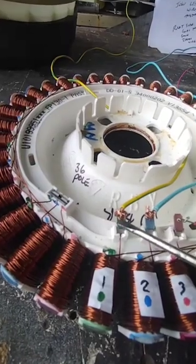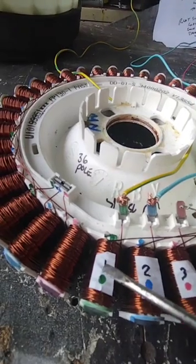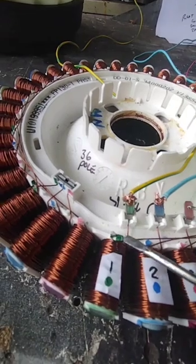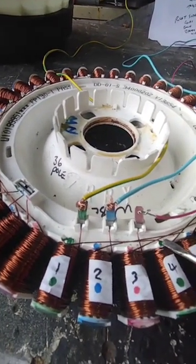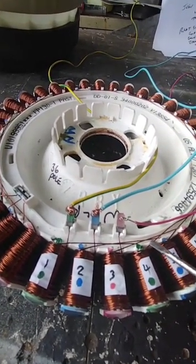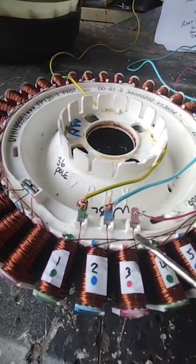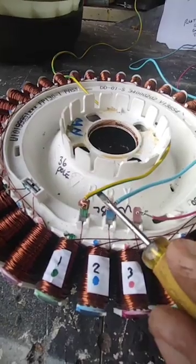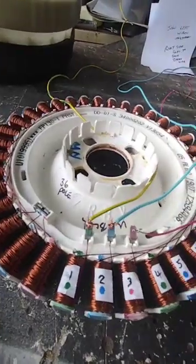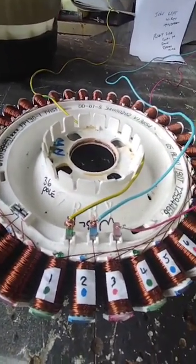Remember: the wire comes from this point, goes to the right side of the coil, winds around about 71 or 72 times, then exits the left-hand side of the coil where they've left a nice long length to reach the next green coil. It does exactly the same thing there — winds around and comes out with a nice long length. We're going to utilize that long wire by cutting it and joining it. I'll show you that in part three. Hope you're enjoying the journey — I'm really just thinking out loud and taking you along for the ride. See you in the next one!